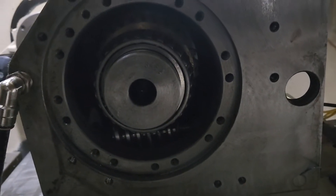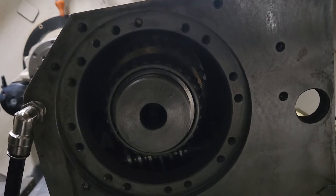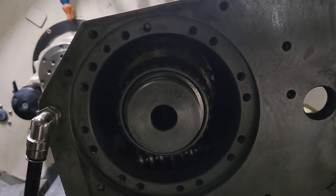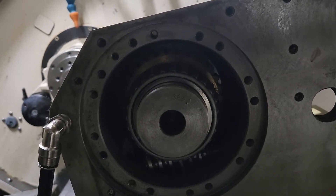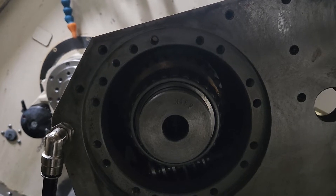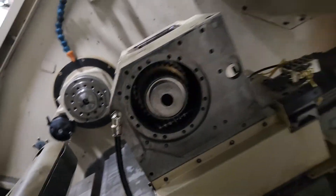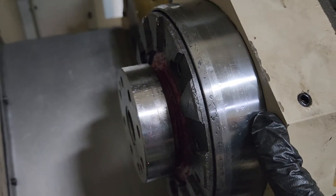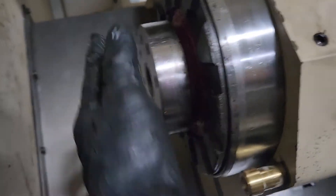So I'm going back together with the turret. I've got the bearings fit, I've got the clamp cylinder in. The spindle's in with new bearings. The clamp cylinder plate. This housing right here that the Curvic coupling is on — new bearings in this.